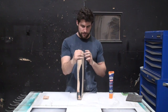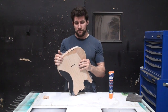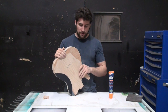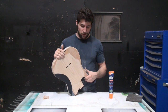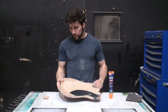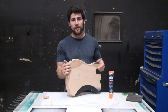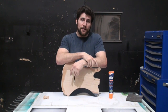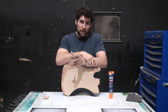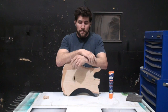They were pretty bad dents. So my next step then is to fill them. And they're considerably less deep than they were before, so it won't be a huge problem. You just want to make sure some of them were areas that were caved in. I'm pointing to stuff you can't see right now, but some of them were areas that were caved in and the paint was smashed in there, but it was still glossy. You need to take that gloss off and sand them so that your filler will stick.